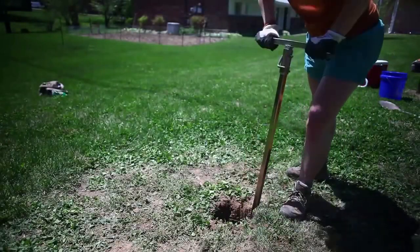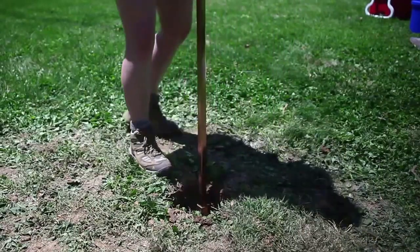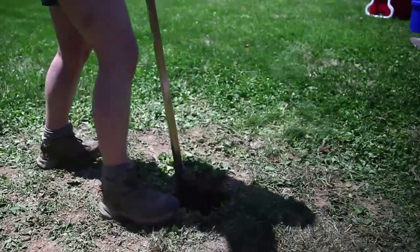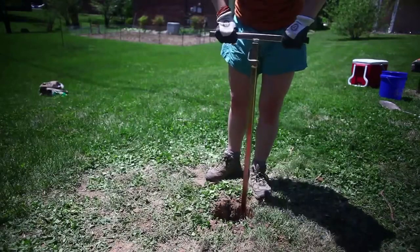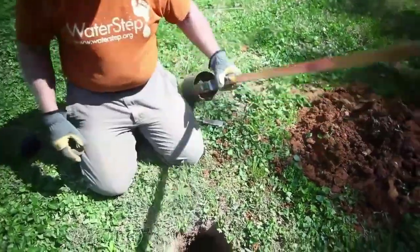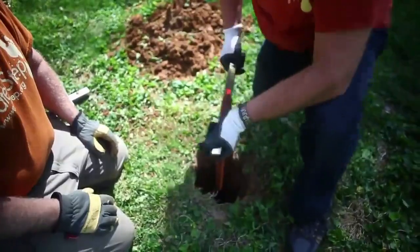Sometimes you have to do this for a couple of feet. Every time you go in and change back and forth, take the bit down on the edge of the hole and walk it all the way around. When you go in before you pull back out, give the handle a little twist — you want to break that up. Then go down through the middle of the hole and bang it down through the middle, twist it. You broke through — nice!